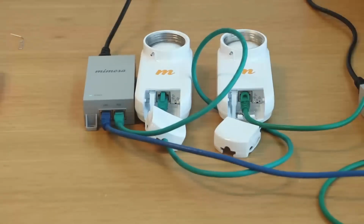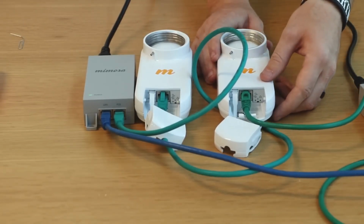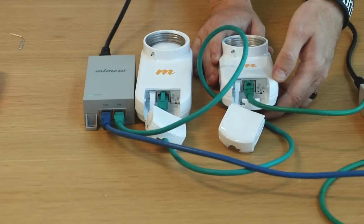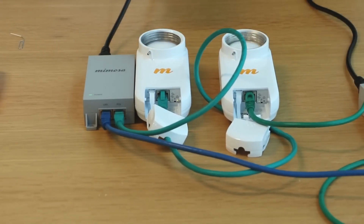Okay, so now that we've got the SSID configured, the radio is linked up. We'll go back to the dashboard, and you'll see that you're connected at -42. Also, if we look at the radio itself, you can see that the light is flashing rapidly. That indicates that you actually have a wireless link between the two radios. So we know that these link up now, but let's go ahead and test internet connectivity too, just to confirm that everything's working okay.